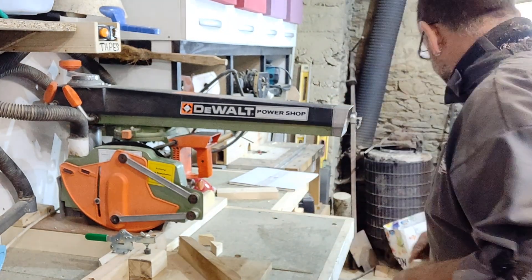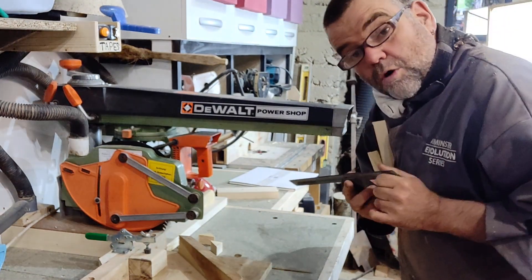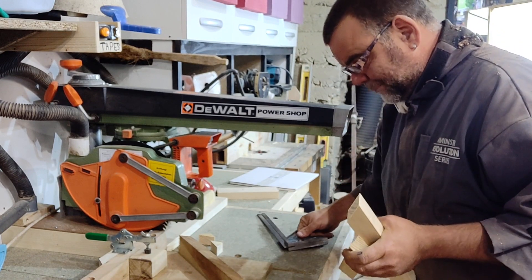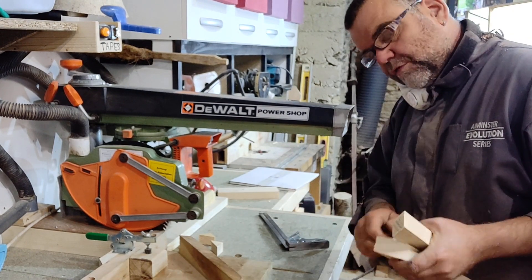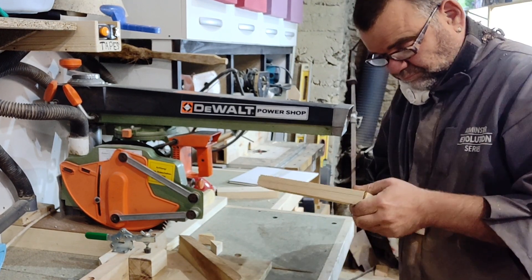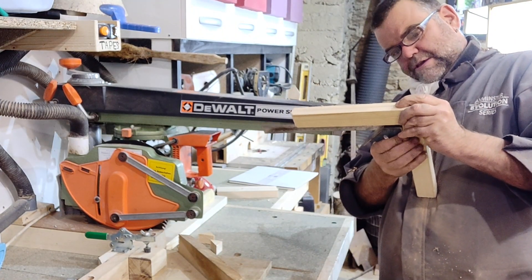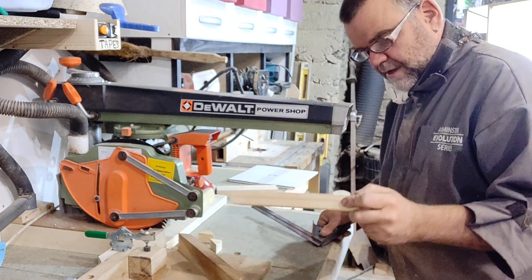I'll show you a bit square — have a look. What I find is this is quite a repeatable system, so unlike when you're using a chop saw and you have to swing that thing backwards and forwards to do the 45s in each direction, this seems to be more accurate for me — well, I think it is anyway. I'll use a square and we're just going to check if it is square. I'd say that is pretty darn square — that's good.